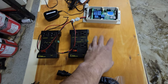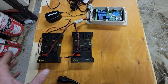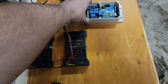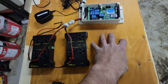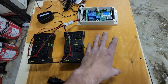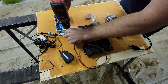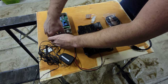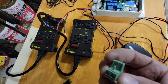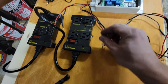I'm in the garage now. My plan is to mount everything onto a piece of plywood which will then be mounted on the wall in the hangar — get it all set up and tested at home, then just screw it onto the wall. I'll mount the two power bars here and the control box here, leaving room for expansion should I add a third power bar or solar power control later. The connector that goes into the side of the power relays is a simple push-style connector with screw posts — your input wires just push in, you screw down the posts, and they plug into the unit.